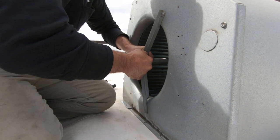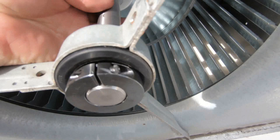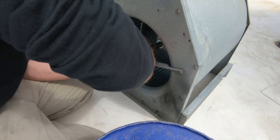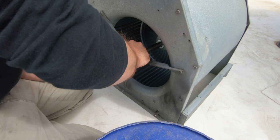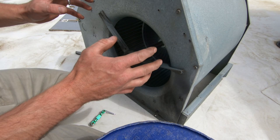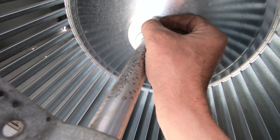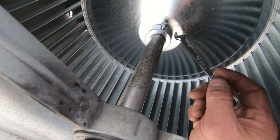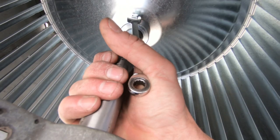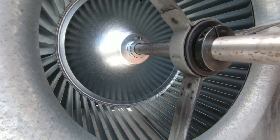As you can see, we've got it locked down and it doesn't have any wobble — it's on there nice and straight. We're going to do the same thing on the other side. Now we've got both bearings tightened down. Next we're going to space this blower wheel evenly right in the middle of the blower housing. This is what we're tightening down to lock the blower wheel onto the shaft — a 5/16 wrench fits on there perfect. Aside from our blower pulley, this blower is rebuilt.